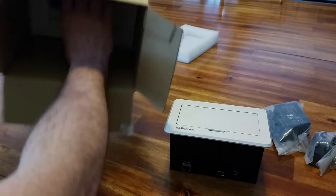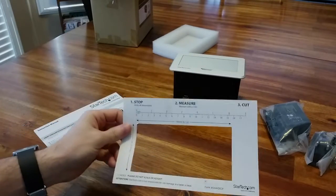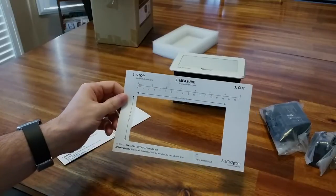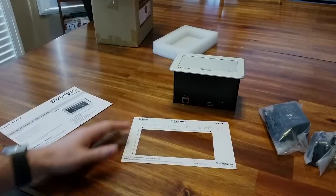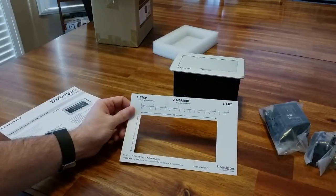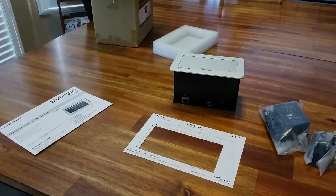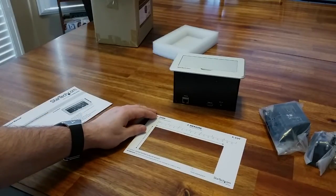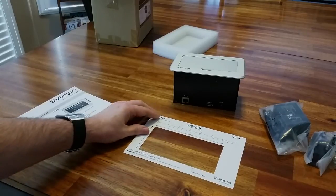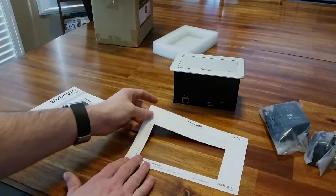In the box you also have a measuring template. When you're going to cut your conference table — I'm a hobbyist woodworker myself, so I say measure twice, cut once, but for a conference room I'd say measure three, four, five times. Make sure everything is in the right place. Before you cut, check what's under the area you're cutting: don't cut without looking below the table first. If you've got steel brackets, braces, or supports — which you usually will — make sure on top it fits where you want it, but also that there's nothing below it, like electrical cables running through there. Just be safe.